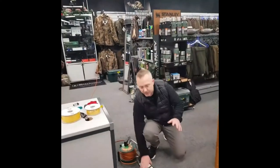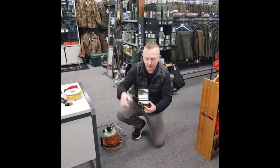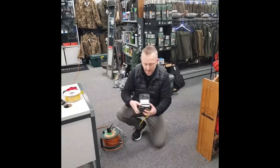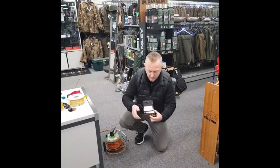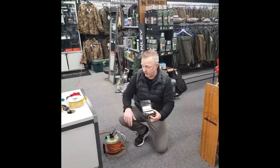If the system is not working, it's broken somewhere, and the wire is broken somewhere down the line, if it disconnects, you know it's not working. You'll hear the beep and you'll only see one light on. So that means if you have cut it with the lawnmower, or cut it with the strimmer, don't be so worried about it. It just means that the wire is disconnected somewhere and you just need to use a connector to get it back together.